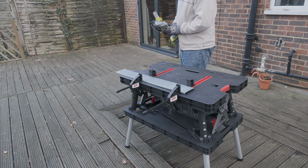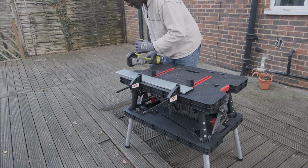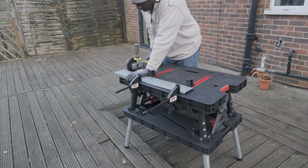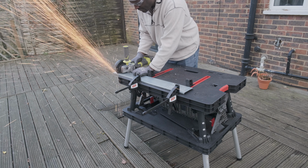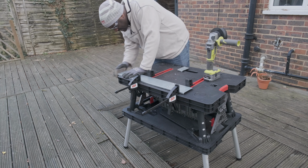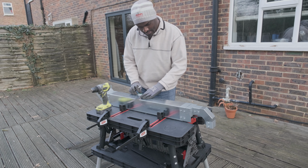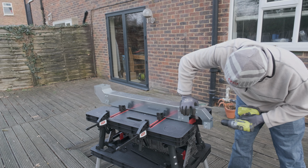Since this length of trunking will end partway into the wall, I'm going to struggle to take the lid off if I leave it as one section. So I'm going to cut off the piece that is going to remain in the wall. After I remember to put my safety glasses on, that is. I give the freshly cut pieces a bit of sanding before going back to the trunking section, where I mark and drill the holes through which I'll drive the screws to fix it to the wall.